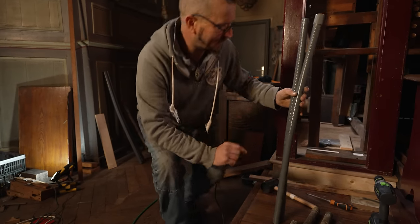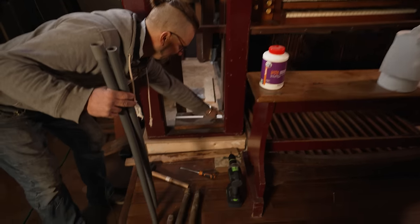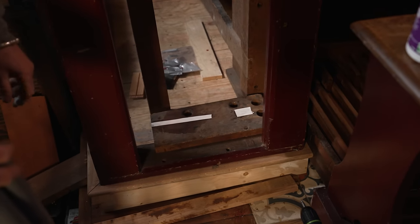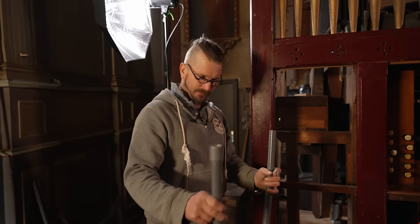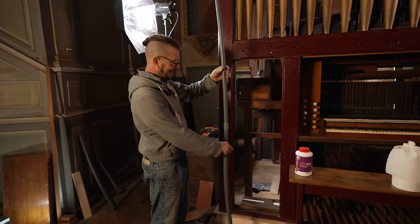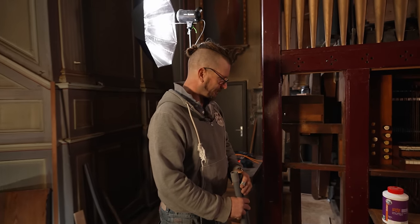And what they do, there's only two. It comes from the top of the organ here underneath the manifold. They go down here and they go into this base plate in these two holes here. And then these two holes you see here and here are for the two biggest tubes that go in. So they sit behind these gold pipes. So the job is, we're redoing them. We have the glue, and it's literally just a case of putting them together, getting them to length, and plumbing them in. So once that's done, Billy and I are going to put the very deepest tubes in of the organ.